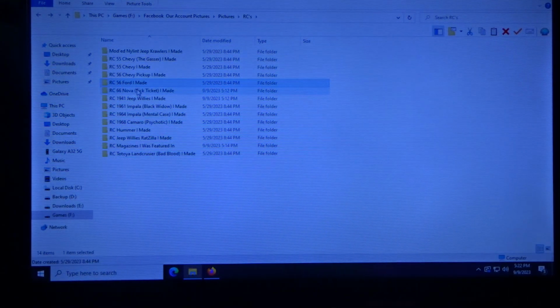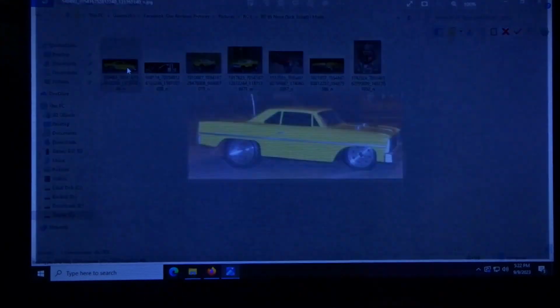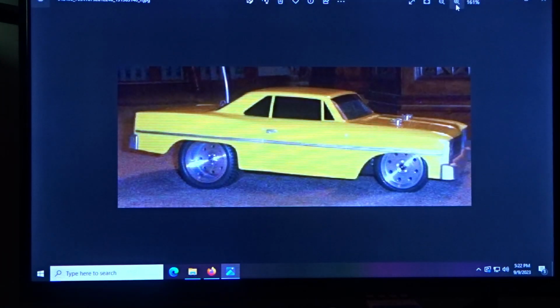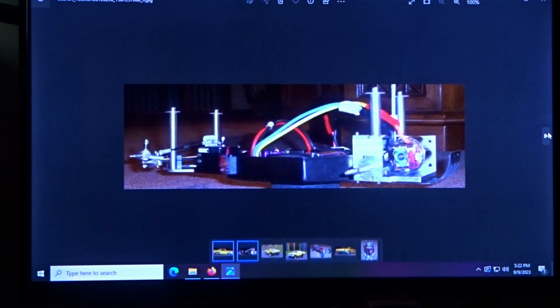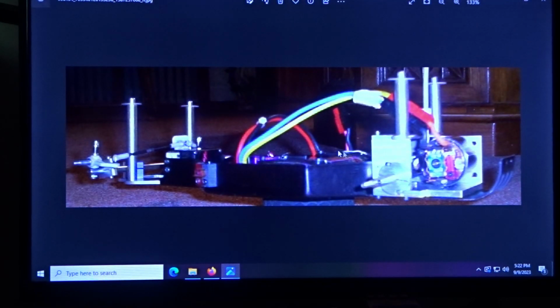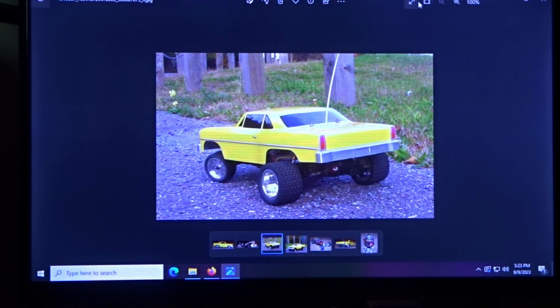And then I got real wild and custom built this one. This one I called Sick Ticket. So this one was actually featured in a magazine. Custom machined wheels. We actually custom machined everything. It was on an RC10 body, and it had direct drive. I machined all of this here, posts, machined the whole front end, and just the tub was basically the RC10.